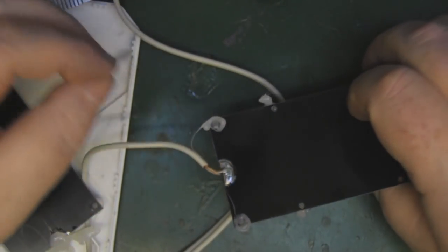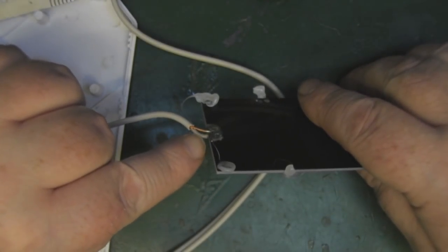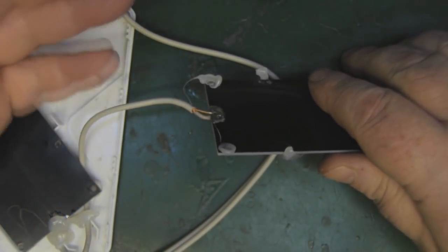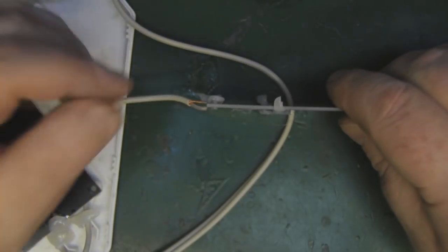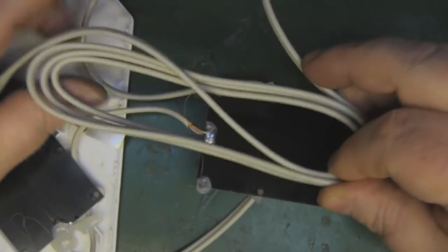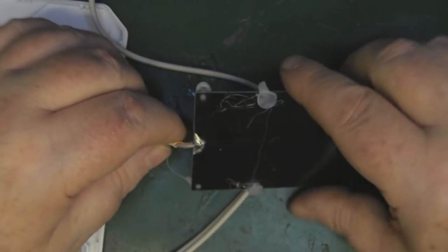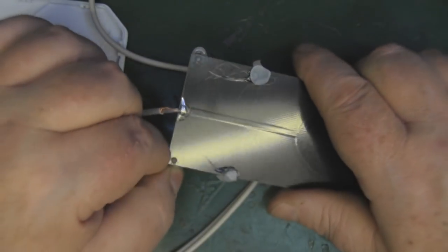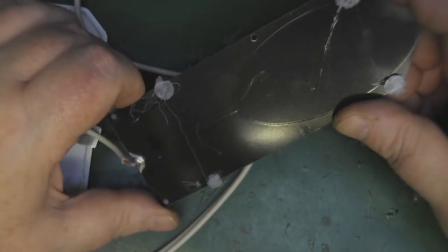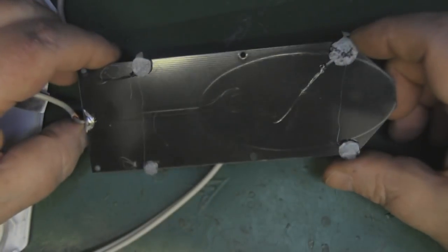We can see enough to tell that this is using really crappy speaker wire coax again — nothing special. In a recent previous video I showed how extremely lossy it is. Even a small length like this means you're still going to lose a lot of energy through the coax, just leaking away and being of no use.